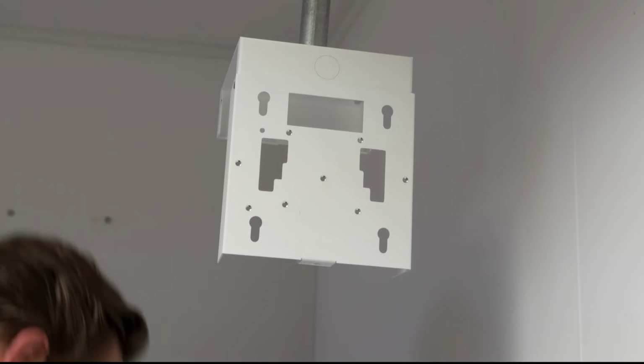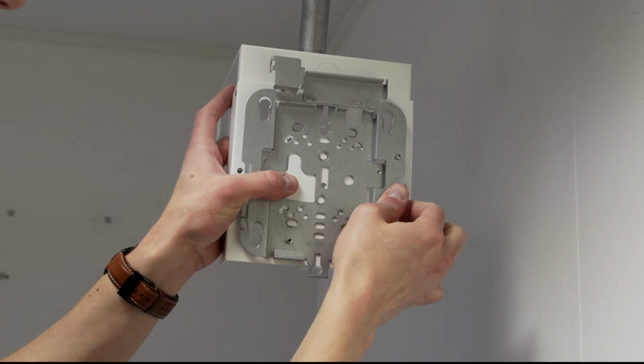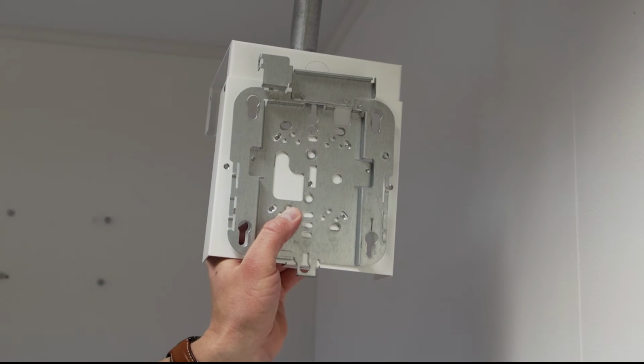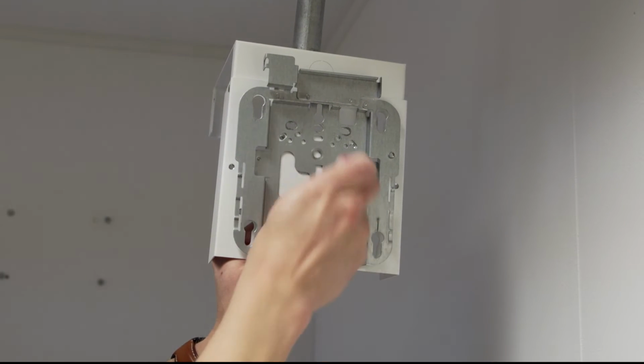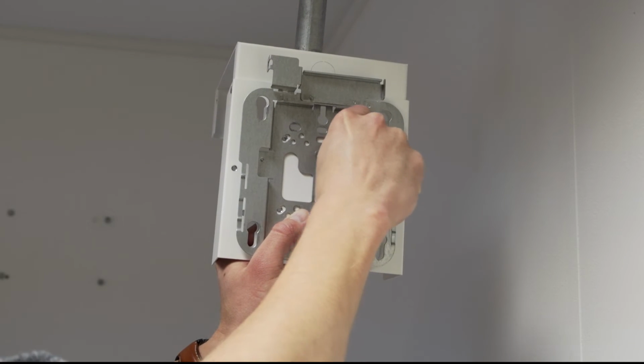Attach the Air Bracket 2 to the mount cover using the 4 8-32 screws provided. The Air Bracket 2 should be aligned with the Oberon mount cover so that the cable entry on the Air Bracket 2 is positioned toward the cutout of the Oberon mount cover.